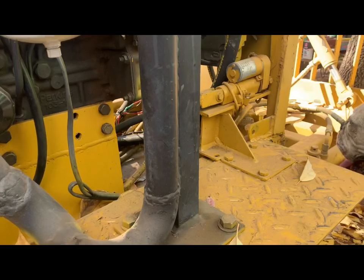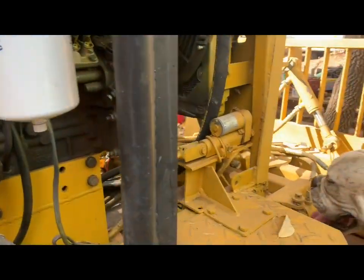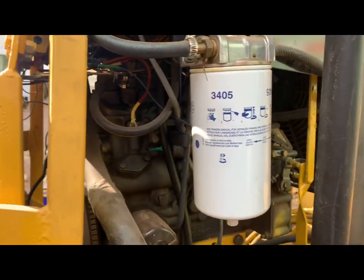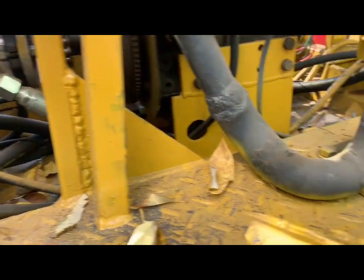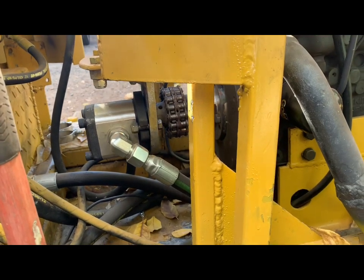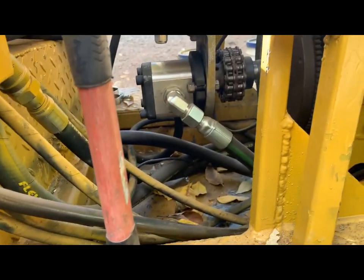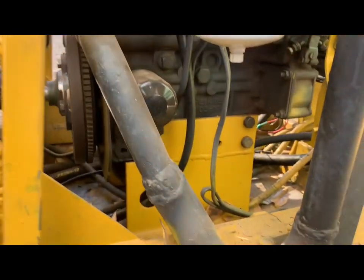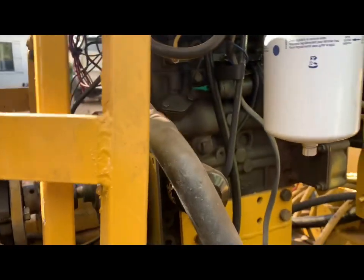You don't have to close it all the way — just slow the hydraulics down to go from forward to reverse. I'm going to put that on a foot pedal, just like a big Cat D7 or something. We have a Cat D7 at work that has a nice decelerator on it. I'm going to do the same thing on this to make it look and work like a real dozer.